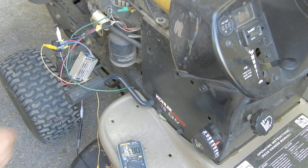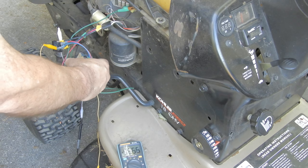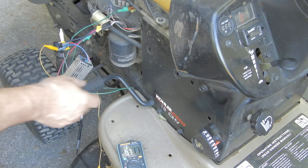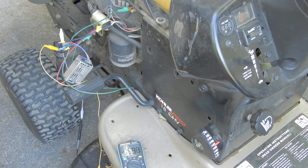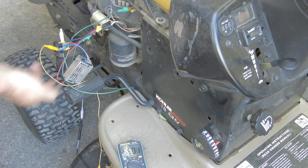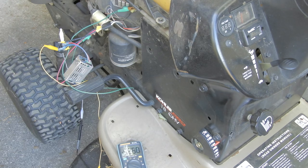It works basically. I'm not going to get warm at that draw. If I was drawing 15 amps I'd have to really heat sink it — I'd need a better rectifier or two. I'd have to cut it into the cowl here where I can get some windage. But I don't think I even need to do that.